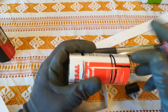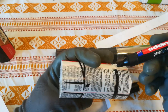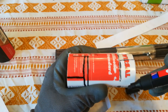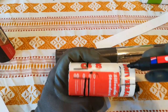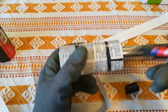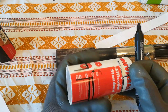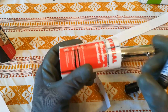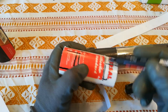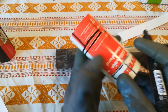Let me explain here — this is how our template will look. All you have to do now is take the angle grinder and cut this segment here that we marked, like this. For this I use a big wheel that's 2.5 millimeters. I put two times the length so that's 5 millimeters from here to here. So you cut it like this until these lines, then cut this one here.